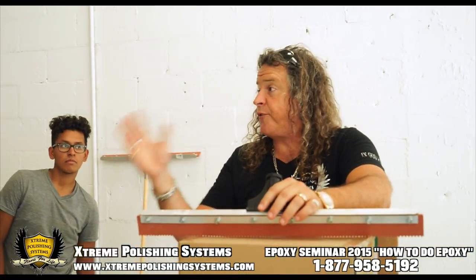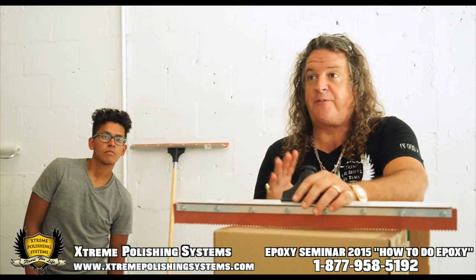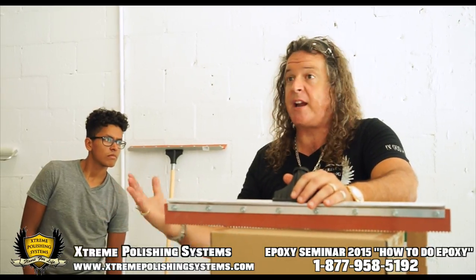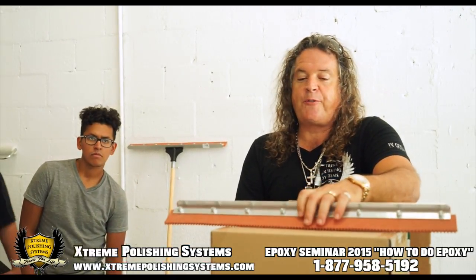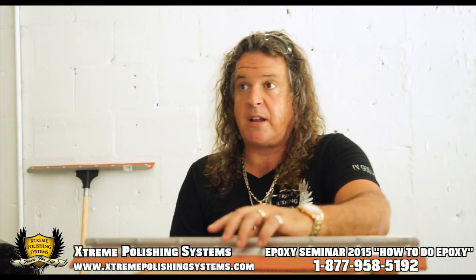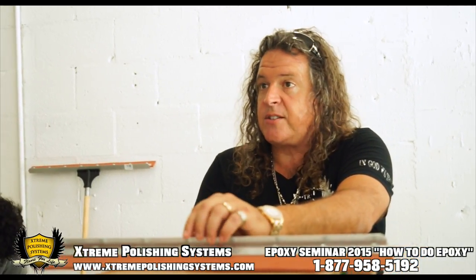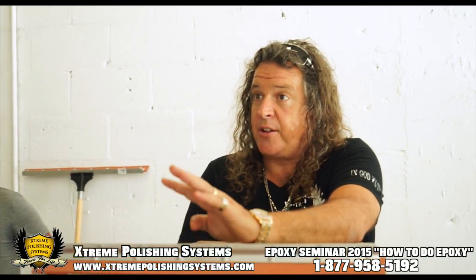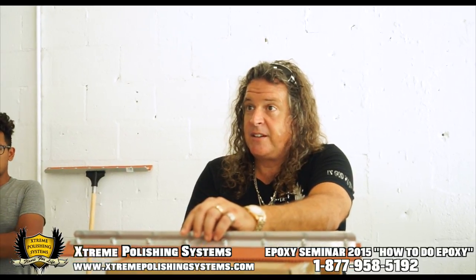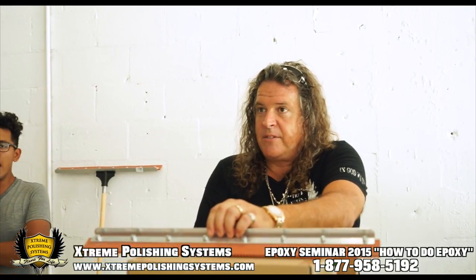So your first job is going to be a 2-car garage, 400 square feet. It's 20 by 20, okay? The first thing you're going to say is, well, how much product do I need? Your first garage is going to be a flake broadcast floor, which is what we're going to demonstrate right now. Square footage on these kits, you will get on a three-coat system, let's say: your base coat, top finish coat, and then an optional polyaspartic coat or urethane.